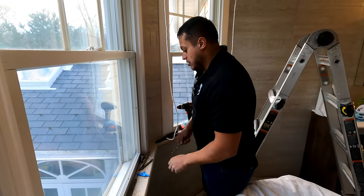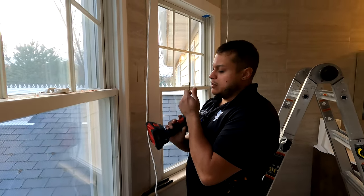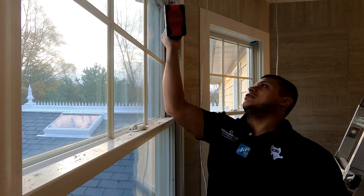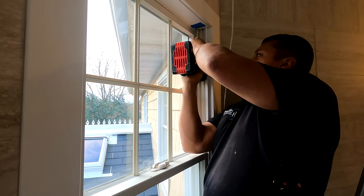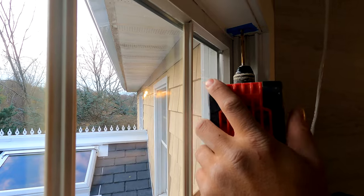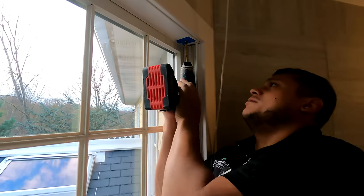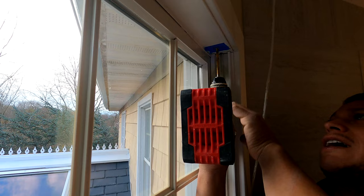What I'm going to start with is a pilot bit — a little bit smaller metal bit. Try not to damage the windows while you're doing this. Make sure the chuck won't spin and hit anything while you're doing this — we want a straight shot up there, and the drill has a clear path of travel. With metal, you need pressure behind the drill to chew through it. Apply a lot of pressure, get a pilot hole going. Start slow, establish a little groove through the plastic, and then start working that metal.